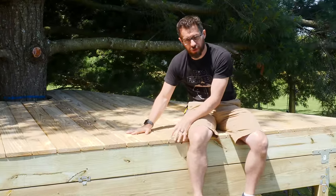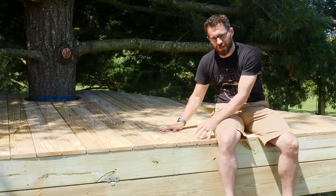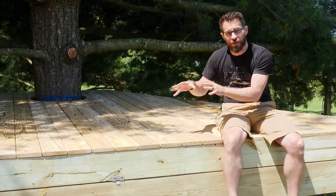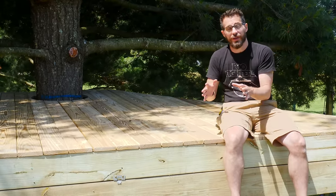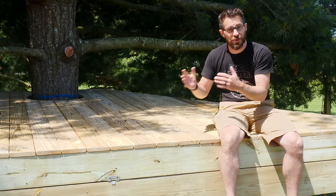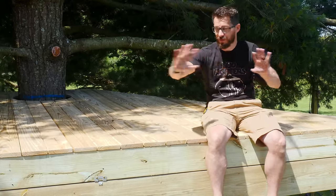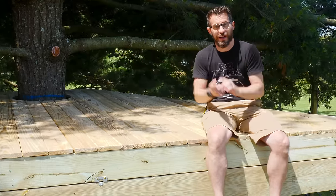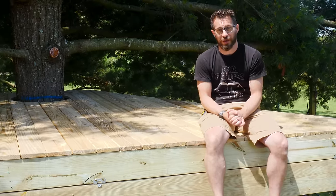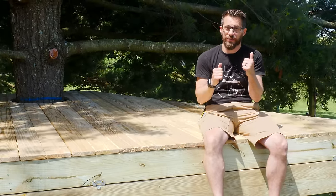Here it is — we've got a great platform to start building other stuff on top of. The individual specifics of a treehouse really have to do with the situation you're in and the trees you're working with, but essentially this is a deck — you just have to figure out how to attach the deck to a tree. If you're not sure how to do it structurally, look at how decks are made and the different ways people attach them to trees or houses or other structures. Next up for this project, we've got to add a way to get in and out of it, add some safety railing around it, and then we're going to add some fun stuff. Make sure you subscribe so you can see that second part, and big thanks to Lowe's for sponsoring this entire build.